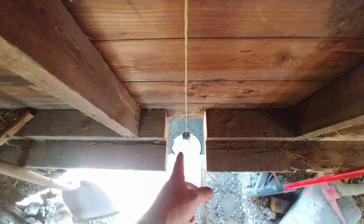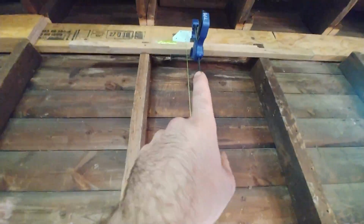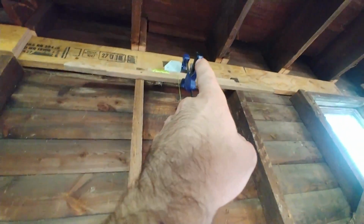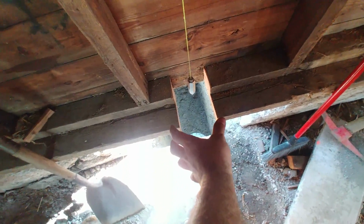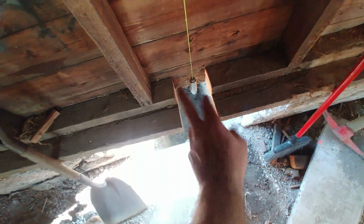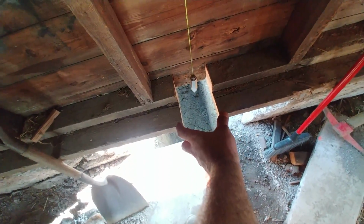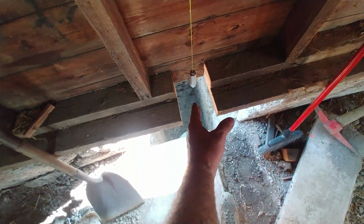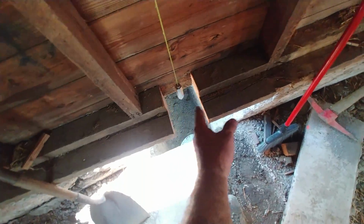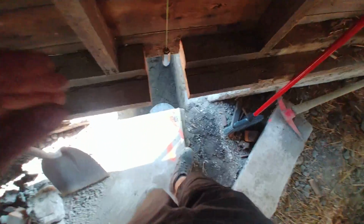But I needed to find out where this footing needed to be outside. So I got the plumb bob around, and I went to the middle hole on that bracket, which has been placed based on the post. Hung the plumb bob down from the center to this plate, made a line there, and those are 4x6 nominal. They're 5.5 actual in the 6-inch dimension. So instead of giving myself 5.5 here, I gave myself 5 3/4. So that's 2.5 plus 3/8 on either side. So it's 2 7/8, 2 7/8. Made a notch, and then I snuck the footing in as close to us as possible.